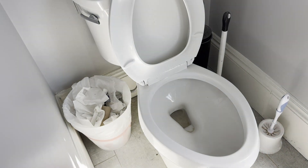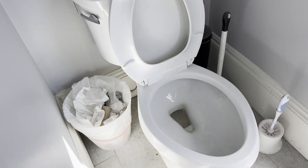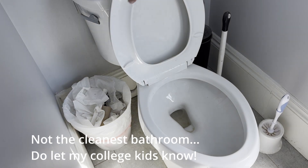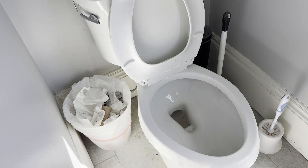This toilet is in a kid's bathroom and as you can see the bowl's water level is very, very low. I'll just flush it for you and you'll see that the water level doesn't come up. With some research on YouTube I realized what's going on is that there is a fill tube that right now should be sending water down the center tube.